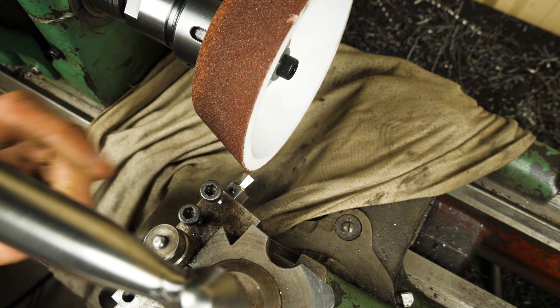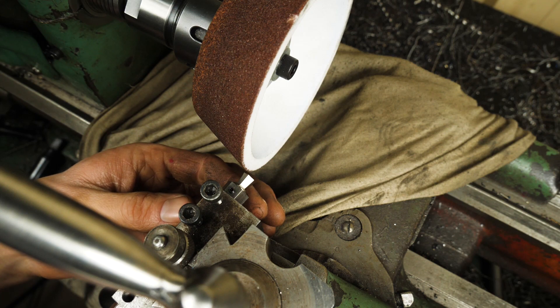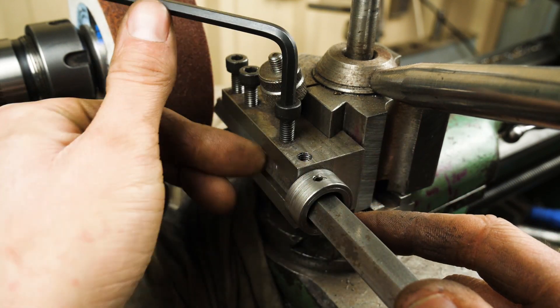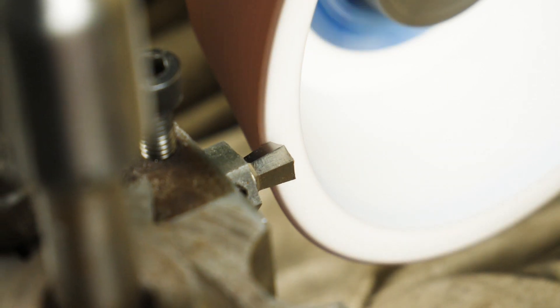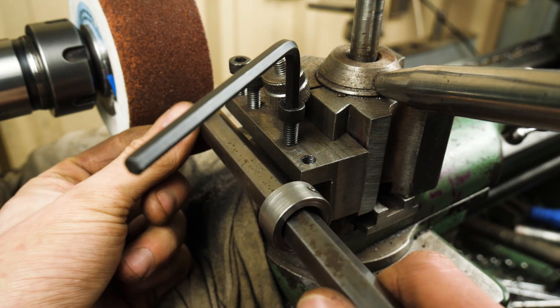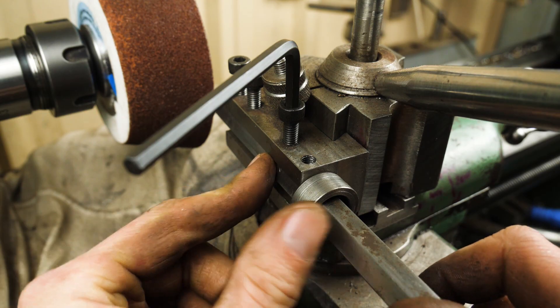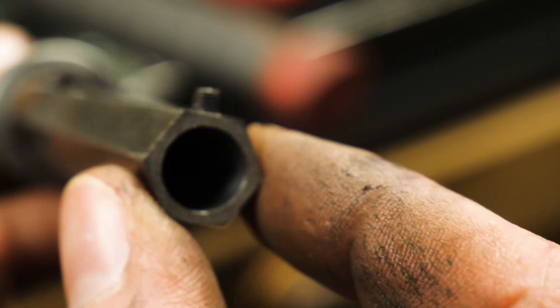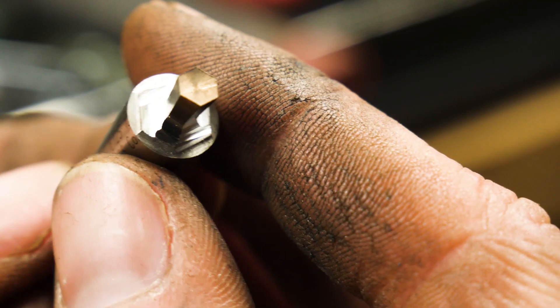The biggest problem with this lathe method is not having a stop. I quickly made up a shaft collar and used a set screw to lock it to the hex stock to fix that. If you're going to use this method, I'd seriously recommend tightening the gibs on your compound so you can't accidentally knock it. You will notice the hex is a little bit irregular — this isn't exactly precision, as the hole was put in using a three-jaw and this is just raw stock. Quick and dirty just to demonstrate the principle.